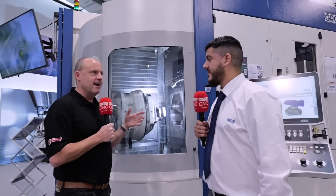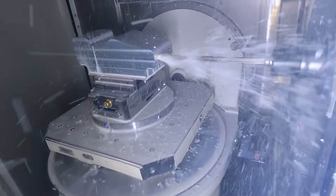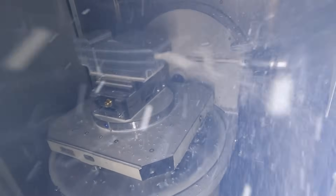I'm going to start with that tunnel concept — what's good about it? The benefit of the tunnel concept is that every time we change a tool into the spindle, it's outside of the working envelope. For example, with this demonstration we use a tool that's two millimetres under maximum length, which is 365mm for this machine. As soon as you bring it in, we've got full freedom — it's not in any collision zone.